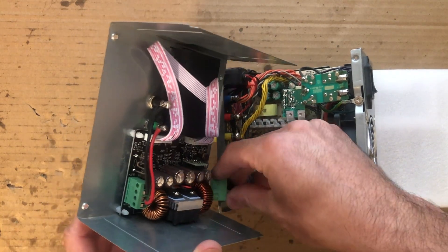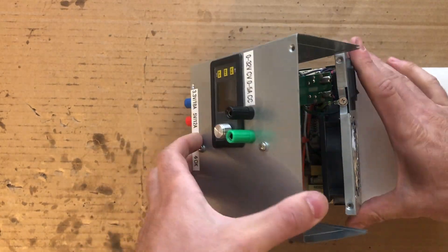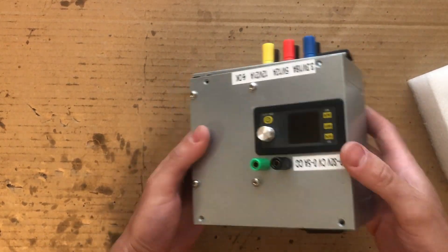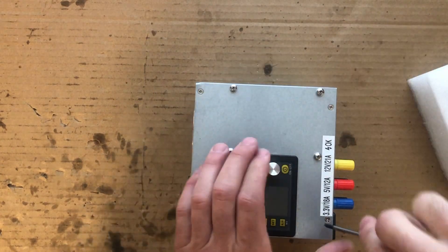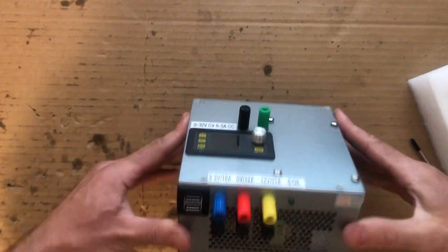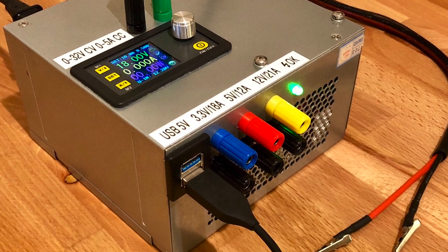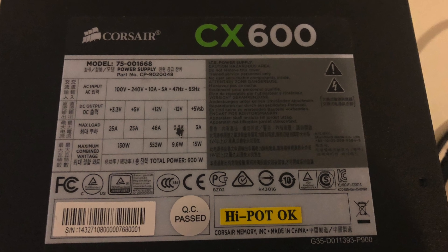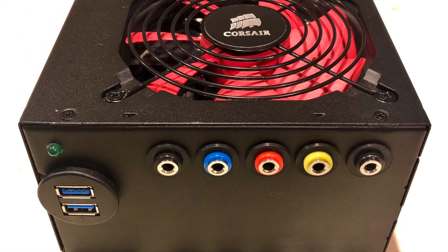The hardest part was figuring out where I could mount the control panel and the actual buck-boost circuit along with two more banana plugs. Once I figured out the mounting, the wiring was easy. I wired the input to the 12 volt rail and ground on the ATX power supply, and then I connected the output to dedicated banana plugs protruding from the top of the ATX power supply case, just above where I mounted the variable control panel. As a bonus, I wired up two 5 volt USB outlets, but I never really used those.